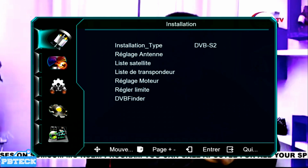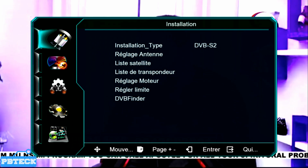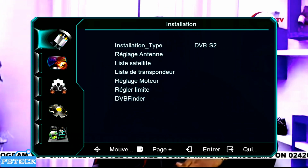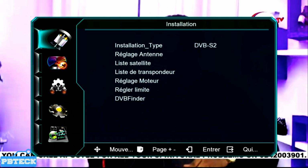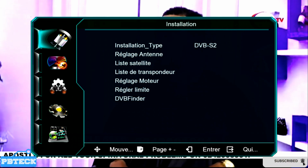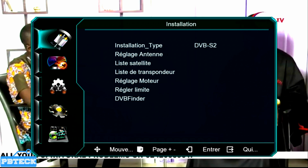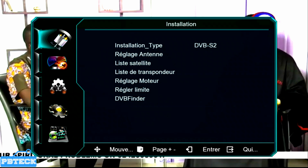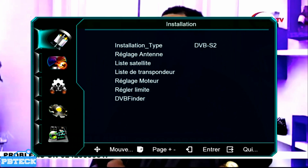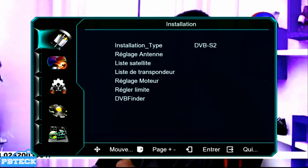The first thing you need to know is you have to get a stable signal from the MultiTV platform. That's Astra 2A/2B at 28 degrees east, using the TP I'm going to highlight on your screen: 12525 vertical 30K. You'll get those FTA channels on that platform. If you don't know how to get a signal, add this TP and turn your dish to face the east, and keep adjusting it until you get a stable signal.